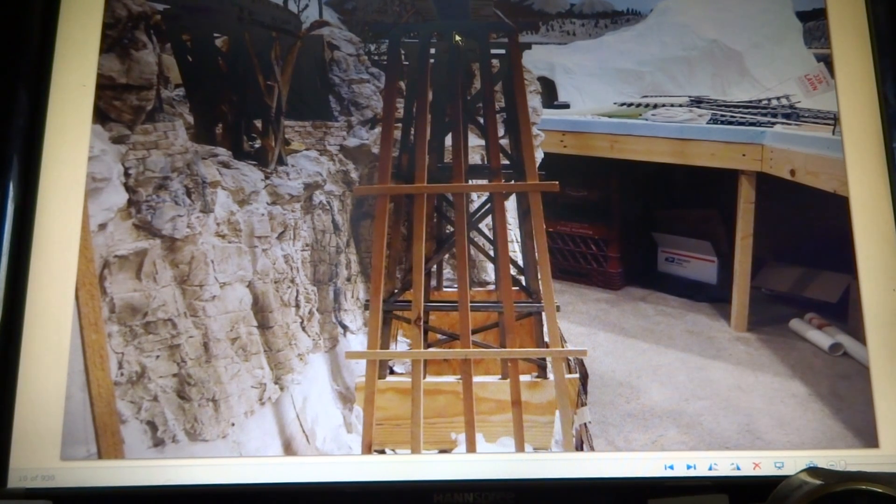I put my center piece in first, knew how wide I wanted to go — approximately two inches across — then put the outer ones about an inch and a quarter in on each side and ran them down to the angle. I took my snipper tool and cut the angle on them, made them all match, then super-glued them up. When they were done I took them apart, then pinned them with a 23-gauge brad pin gun — that makes them all nice and tight. Each bent is about 18 to 20 feet, and you do that all the way down, doubling them up with cross members on each side, any way you like — no laws, no rules, no regulations.